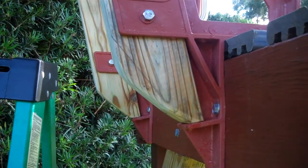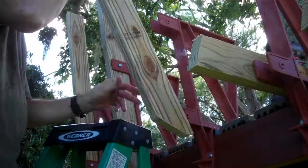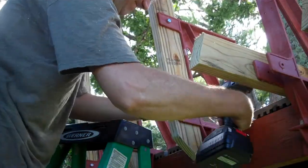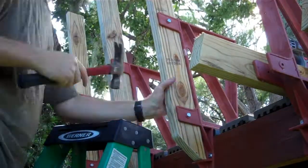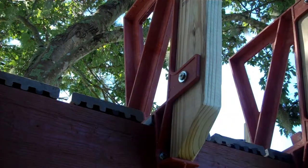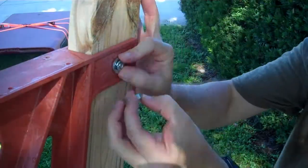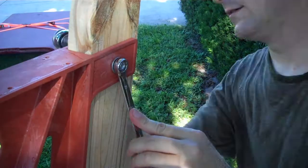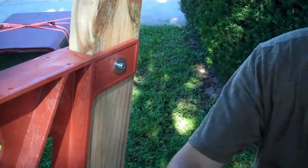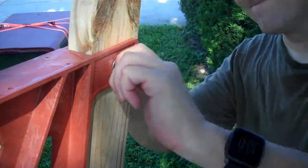This is what they look like in place. To hold the uprights to the brackets, you just drill a 5/16 inch hole using the brackets as a template and bolt them on using a fender washer, lock washer, and a nut. I was using pressure treated lumber, and the length of the bolts is very close, so I had to take off the lock washer, use the nut to compress the wet pressure treated wood a bit, and then I was able to fit both the washer and the lock washer onto the bolt under the nut.